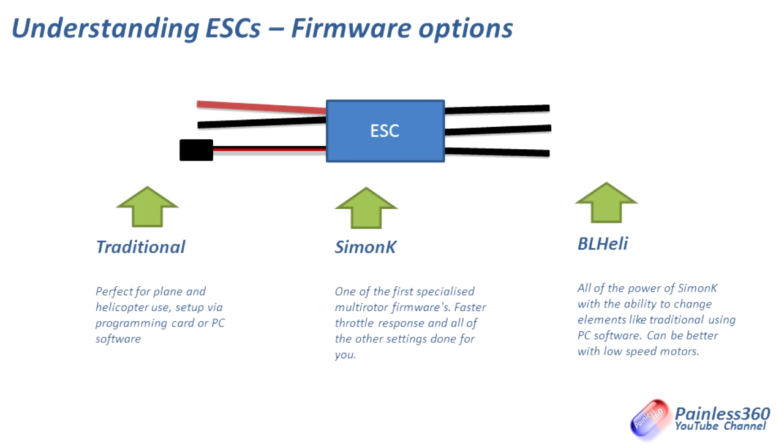My personal advice: get one or the other — both will work really well in the majority of instances. Buy ESCs that come pre-flashed with either SimonK or BLHeli if you're going to use it for a multirotor, and make sure it has a bootloader installed. When you order your speed controllers, I'd always recommend ordering a spare one and ordering whatever associated USB cable comes with it for programming. That way if you find there's a problem, you can change your mind.